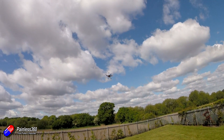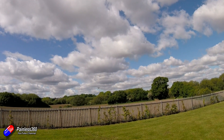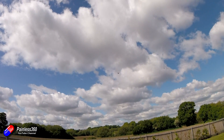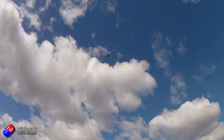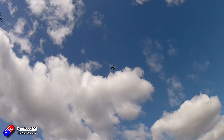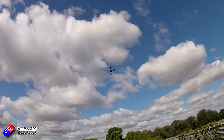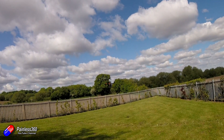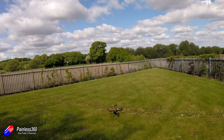I'm happy with that. I'm going to try a return to home — let's fly a little bit further away, just park it over there. Let's hit return to home. It's going to rise to the predefined altitude in Mission Planner and then come back. The compass and everything is working. I'm just backing off in case it makes a mess of this. It's going to loiter above the home location and then start gently descending. I'm not touching anything on this — this is return to launch, and it's also what would happen in the event of a failsafe. It's going to gently bring itself down to the ground. It's a couple of meters away from home location but that's pretty typical unless you're using one of the RTK GPS's which are very expensive. Battery level one alert. Disarmed.